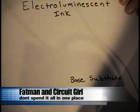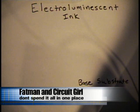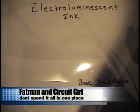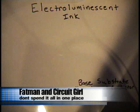So you'd have a clear substrate — I'm going to use this piece of paper as the substrate — which corresponds to the transparent plastic that the light is shining through. I'm going to use transparencies to illustrate this. You would put down a translucent conductor, which is made out of typically indium tin oxide. So you can see right through it, but electricity will flow through it. It's one of the rare transparent conductors.